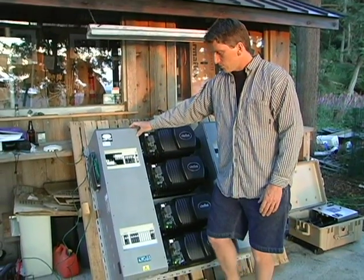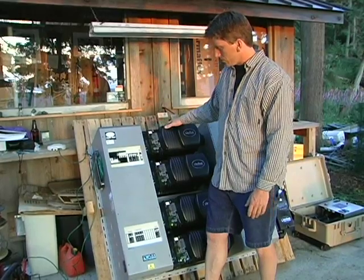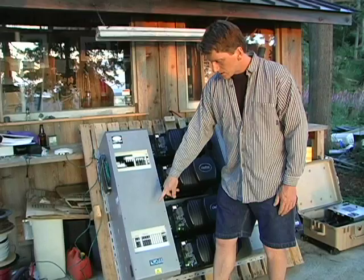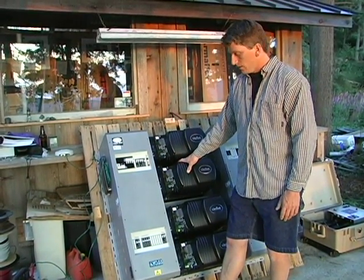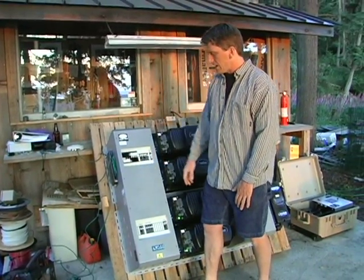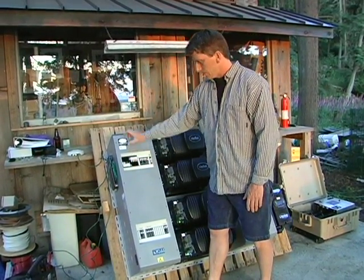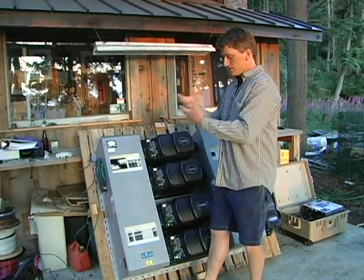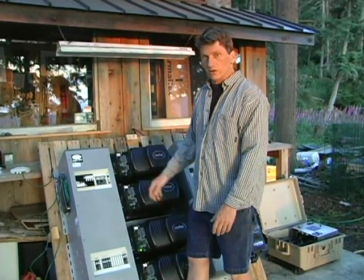This is the AC circuit breaker enclosure. It's got circuit breakers that protect the wire, the inverters, and the loads for the power coming out of the inverters, as well as inverter input. If there's a generator, it will be wired in here and goes through a circuit breaker as well. There's also a bypass here, so if something goes wrong and you need to run straight off of the generator, you can flip the bypass. That de-energizes the inverters, and the inverter could actually be removed from the system, but all the loads will still function as normal with the current going straight from the generator to the loads.